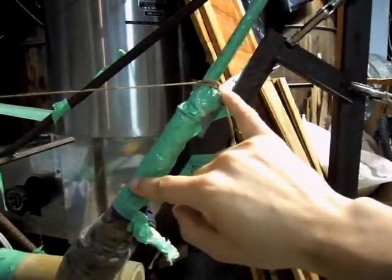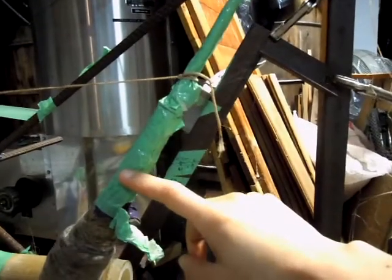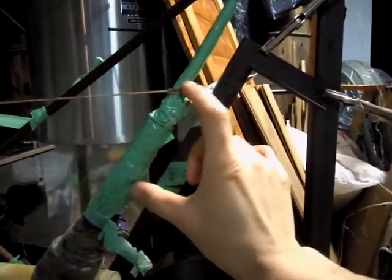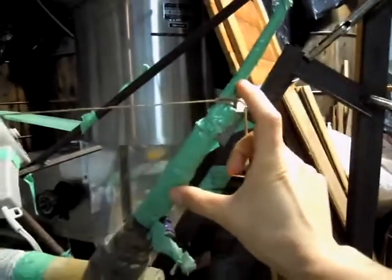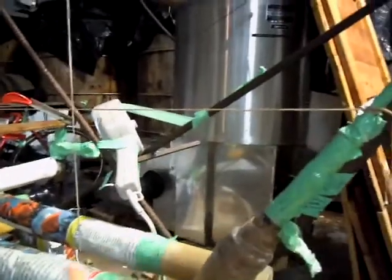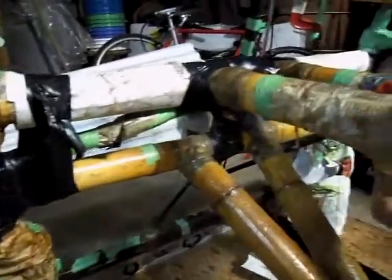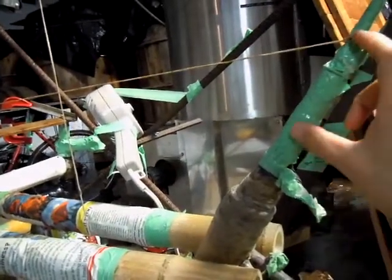So I don't think we're going to be able to get the seat down that low, really. I think it's not reasonable. So my working range is going to be about here, this much. And if he's wearing shoes, maybe this can even come up a little bit more. And that'll be fine. So I'm doing my planning in terms of his knee and a cross brace from here to here, such that it won't hit his knee when the seat is in this range.